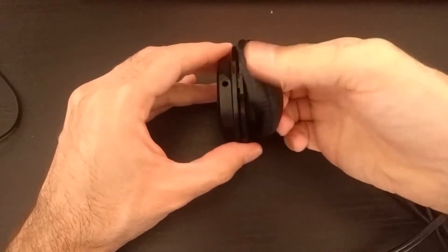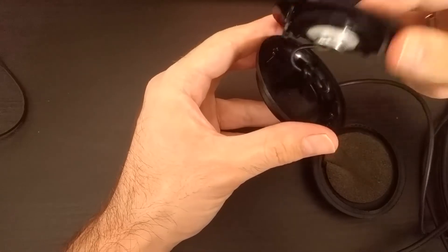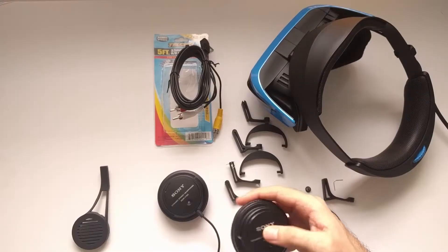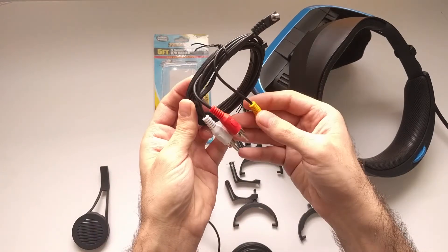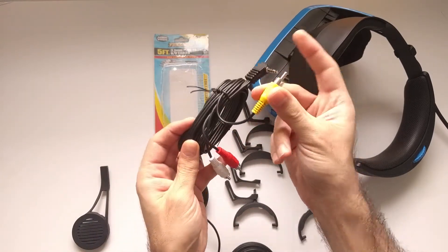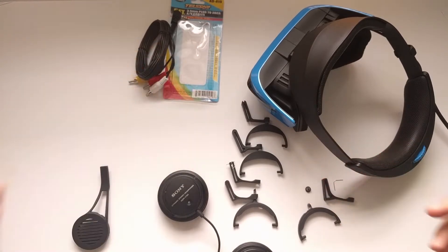The wire inside was broken, so in the same effort I have soldered it and shortened the cable. If you also want a microphone, get this $3 cable that has an additional contact for the microphone. This is an AV cable for an old camcorder, but the video-out contact is the same one as for the microphone, so you can solder any microphone you want.